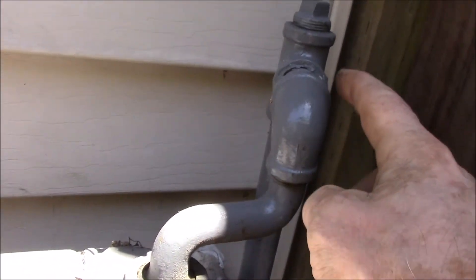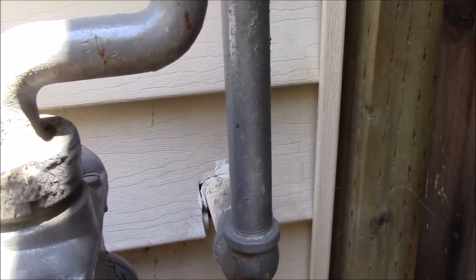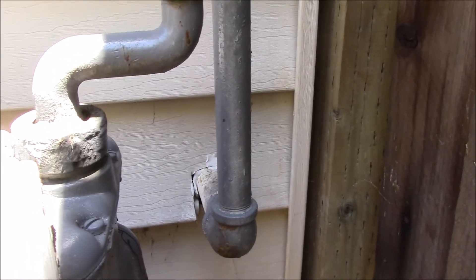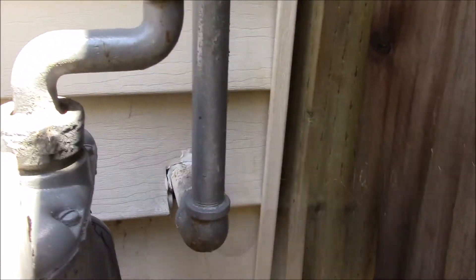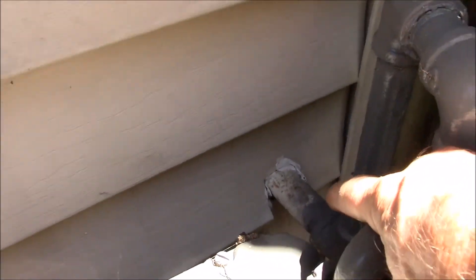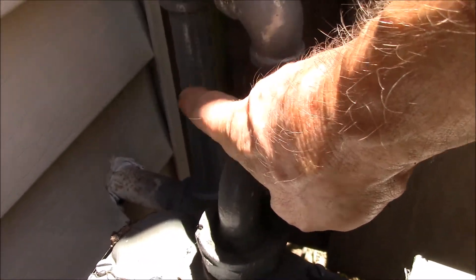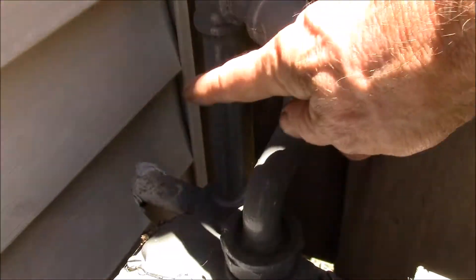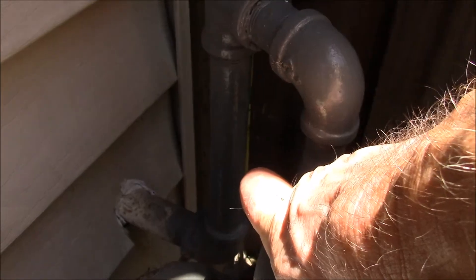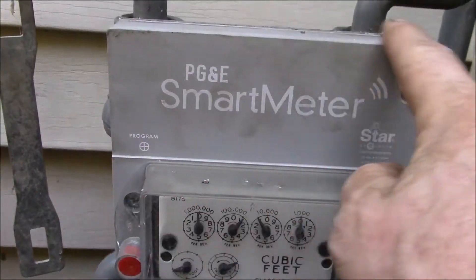This is the house side of the meter. They come out of here with a half-inch pipe, then go up to three-quarter inch, and then down here there's a three-quarter to one-inch adapter — so you've got three different-sized pipes right there, which is kind of interesting. There's no drip leg that I can see. They run into the house with one-inch pipe, and I'm guessing they run a trunk line down the middle of the house with one-inch and then feed off to the various appliances.